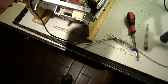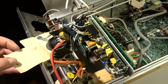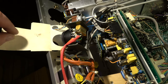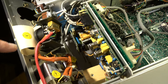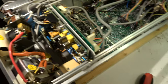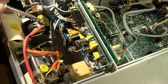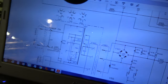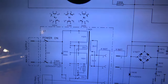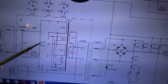Here is the switch for the voltage range. And on the other side of the board, you will see a spot — a burn mark caused by this capacitor here. This capacitor is broken. It is a filter capacitor on the mains side, the 230 volt supply side. It looks very ugly. The mains line comes in here, and this filter cap is broken.